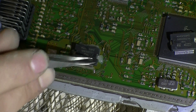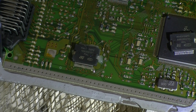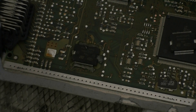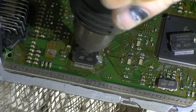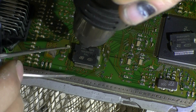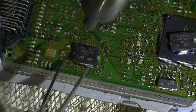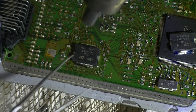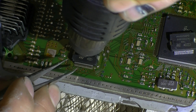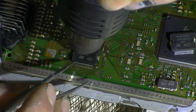So let's get things underway and heat this IC up. I'm going to start off at reasonably low airflow — maybe just a little bit harder. Now because we've got such a massive ground plane underneath, we're going to have a little bit of trouble actually heating that off the board. We really do need to concentrate on the bottom there.